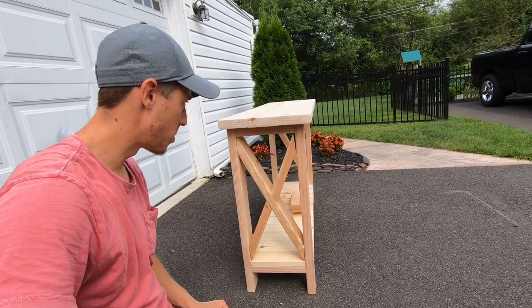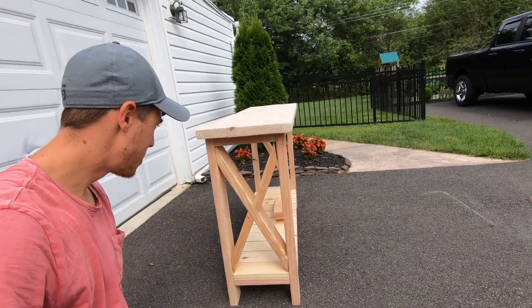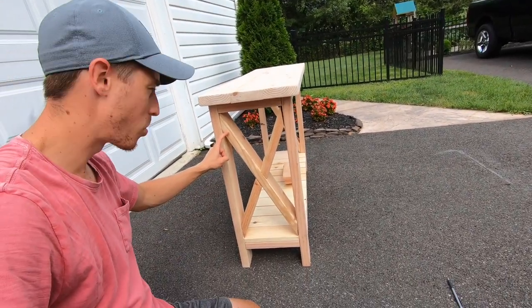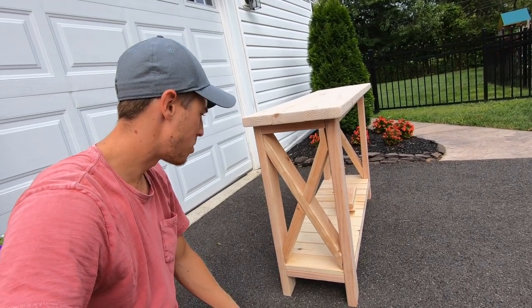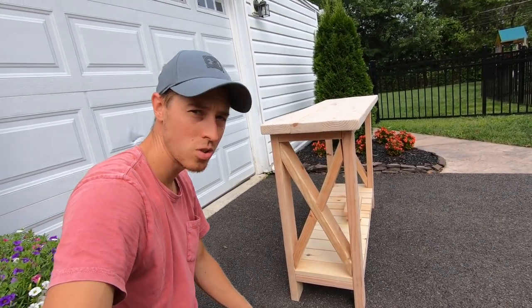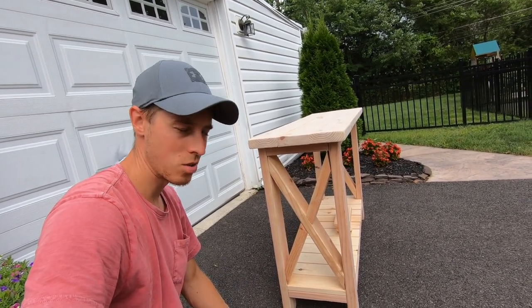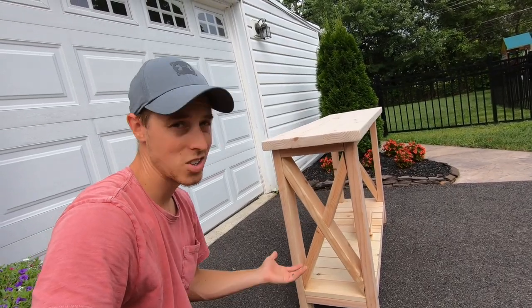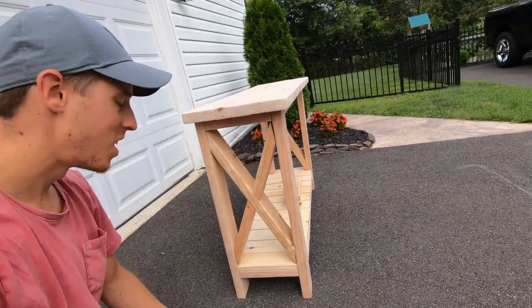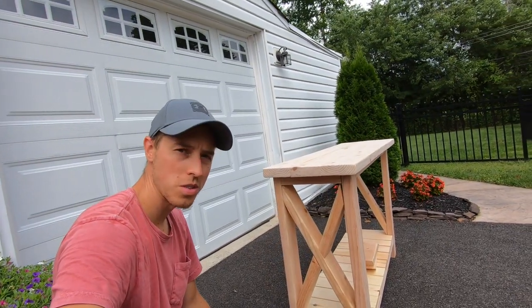I think if I was going to do this again, I would delete the X's, because that was a pain. I think that the 2x4s look a little too bulky, so I think what I'm going to do is throw them through the table saw and bring them down to 2x3s. In the picture, they use 2x3s, but whenever I look at Home Depot or Lowe's, the 2x3s are always so twisted that I just got 2x4s, with the intention of ripping them down to 2x3s, because I just think it looks a little too bulky here. So let's go ahead and throw them through the table saw.